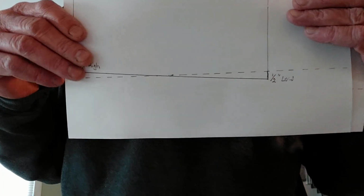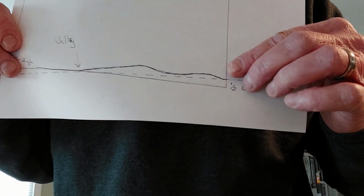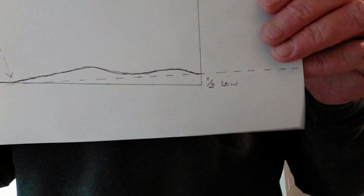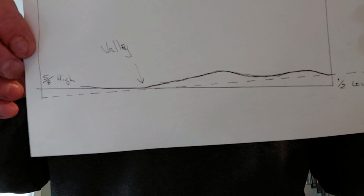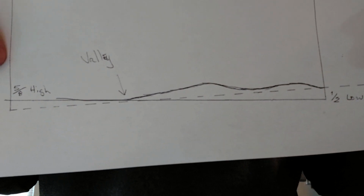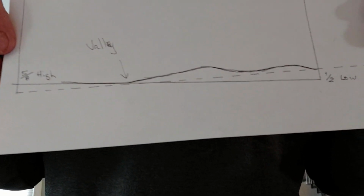So they came in with underlayment, Ardex, I do believe, and they fixed this low spot. However, when they hand troweled it, they created a slight hump right there just outside, then a dip, and then a much higher hump. And then maybe they decided they couldn't correct it, and they turned it into that valley that I just showed you with my level. So, as you can see, this floor is a mess.